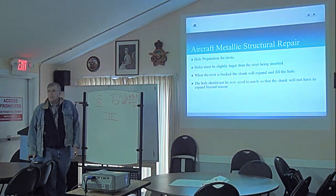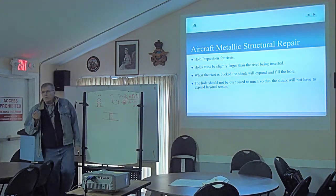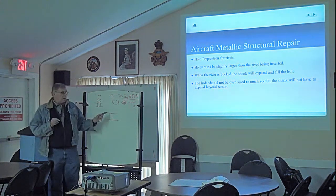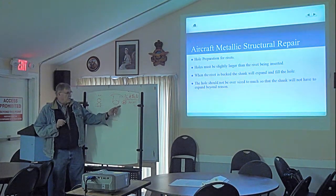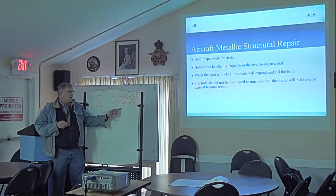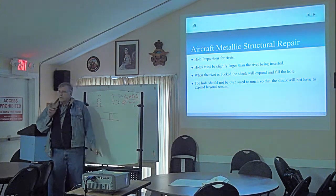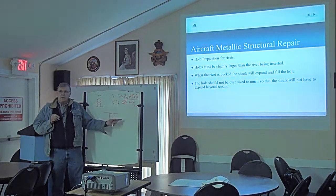Student question: What is the forty, thirty, twenty? That's not metric, what is that? It's a wire gauge setting. When we work with all the different standards out there — SAE standards and all those kinds of standards — it starts at zero and works its way backwards, which seems counterintuitive. You can go up to eighty, which is really, really fine — hard to even see. You can go up to zero, and zero is about a little bit larger than a quarter of an inch. Does that help?